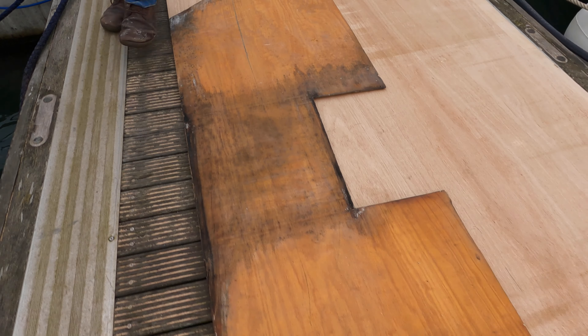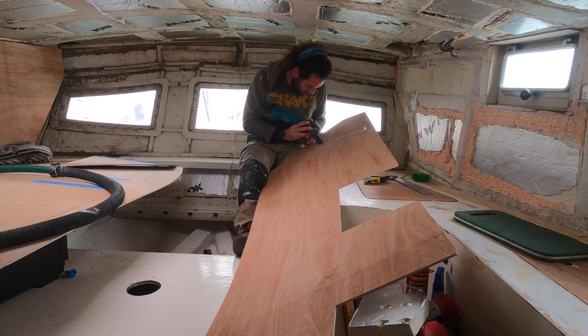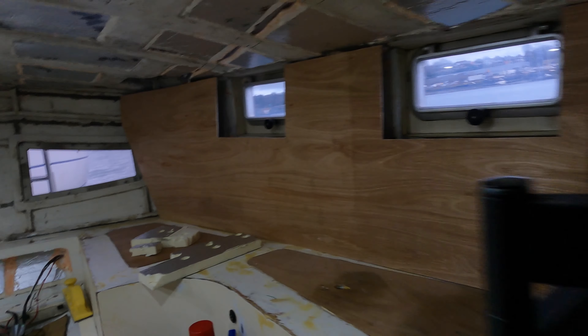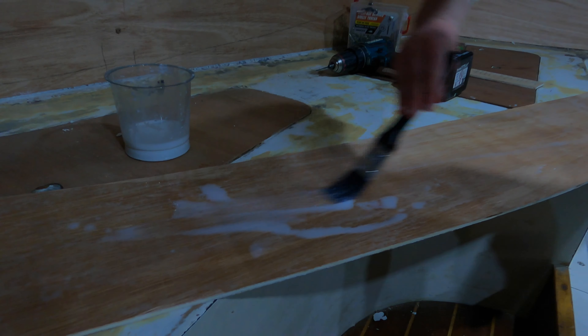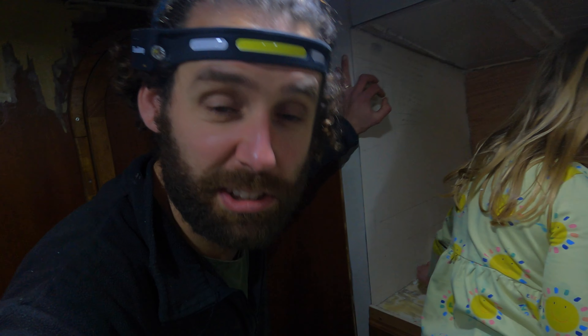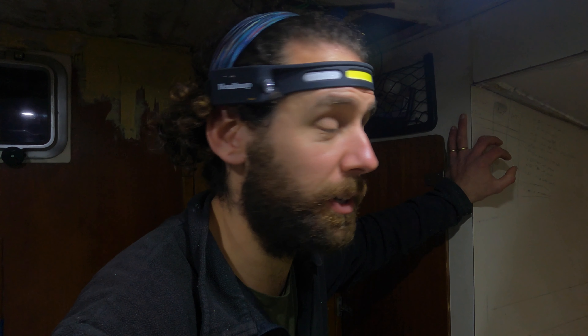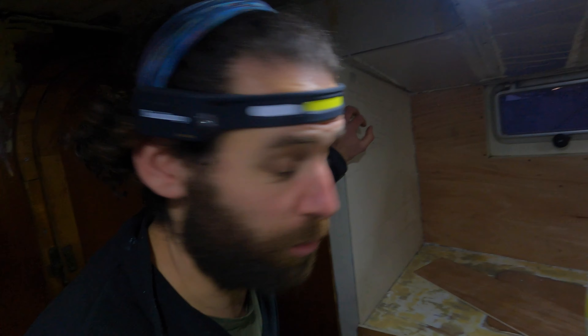And slowly but surely it began to take shape — we used the old panels as a template to make new walls. PVA glue and water mixing together. The ratio doesn't matter too much but about half and half, maybe a bit more water — turn it into a paste and you brush it onto some timber, as Tilly's doing here. The water evaporates off and it seals the wood. This is just for the back of all the timber going in, so the back sides of the timbers which are all generally glued in anyway. So there should be no ingress, but if there is ingress, it helps seal them up.